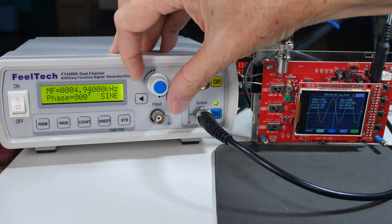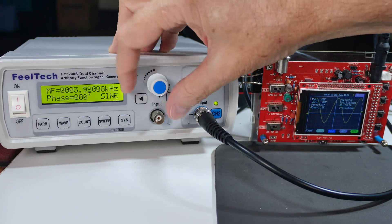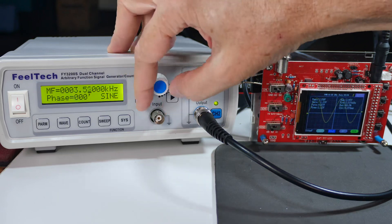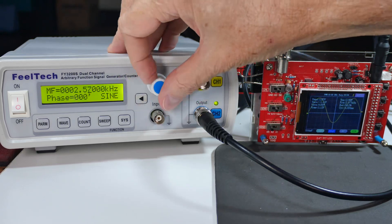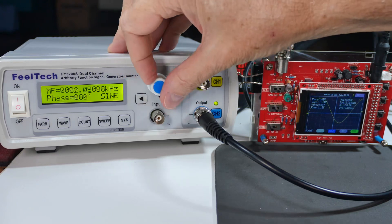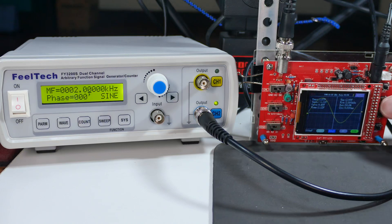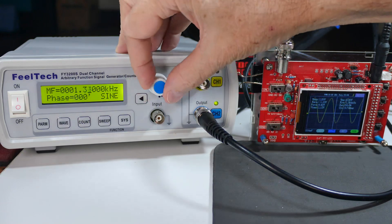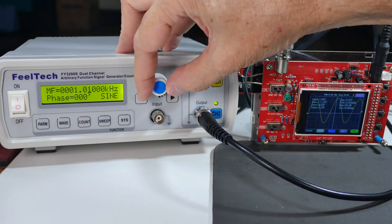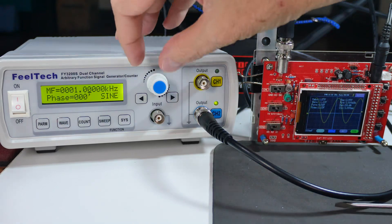There's 5.2kHz. Let's see how low this will go — 4kHz, high 3s, no problem. High 2s. Checking our detail again: we're showing closer to 3 volts and frequency is right at 2kHz, which is good. Let's reset our timebase a little. Continuing down — 1kHz. Yes, it's got that nailed. Clearly at the low end it does much better for accuracy.